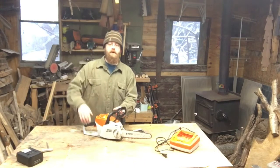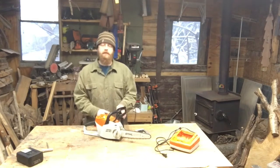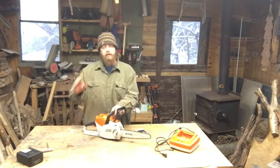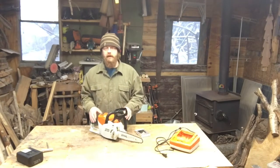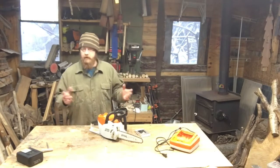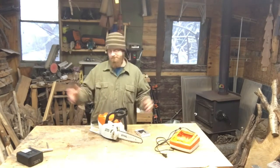Why do we remove the battery? This isn't a gas-powered saw. With a gas-powered saw, you would just shut it off and you're safe enough to work on it. With a battery-operated saw, there's always that risk that something could short out, your chain could turn on, and rip your hands apart. I always like to take it out. Somebody might say there are enough fail-safes on there, but I like my hands. If you like yours, take your battery out — what's it hurt, right?